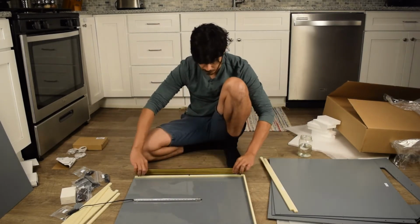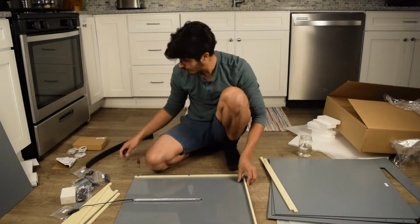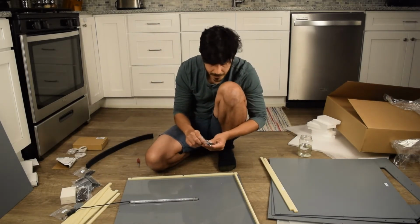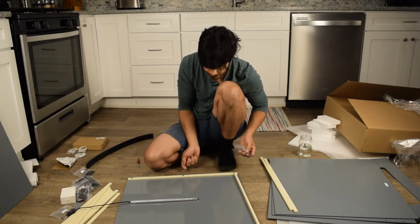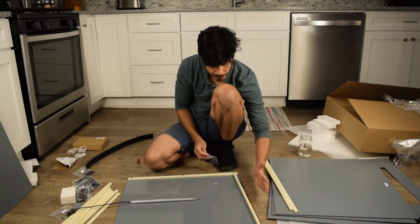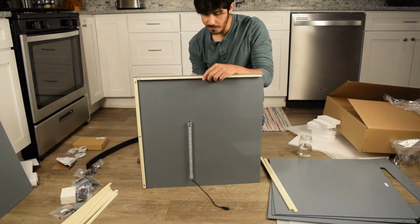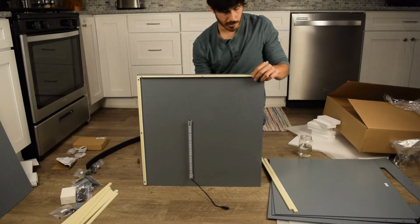These are vertical pieces, so this one lies flat because it's the front of the enclosure, and that's where we're going to put our weather stripping on. This one's vertical because it's going to connect the other piece onto it. Now for these, since they're vertical, they're a lot longer. You need the 25mm. So basically, when it's vertical, 25mm through. When it's the flat side, 16mm. So 25mm for this side, but when we put the other panel on the side, then we use the 16mm. The 25mm do stick out a bit, but this is in the vertical direction, so your printer won't run up against it.